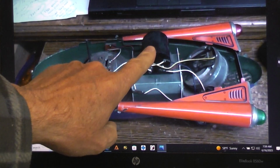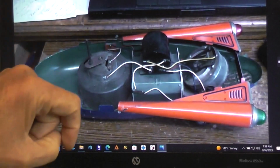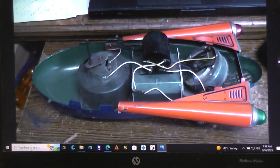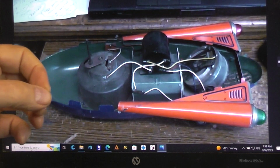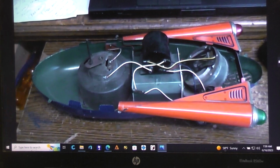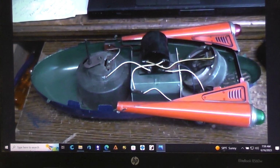Inside this black box right here, there's a very sensitive relay, and this had separated, and the relay was out here banging around out in the open, which probably explains why some of the wires were broken off. And also down in here, which goes to that drive motor assembly that we talked about, there was a cold solder connection on the motor inside that drive motor assembly, and so the motor was very intermittent, would work sometimes and not work other times.